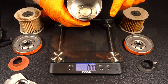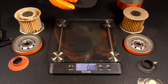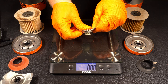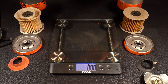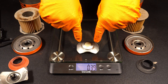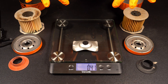Now this spring sits in here and kind of just flops around, whereas the new one doesn't have a whole lot of room to slop over into the wrong spot. The new one slides real nice, whereas the old one - could be an age thing - you can almost hear a crunch on some of these pushes. The metal on this old one comes up in a dome and then comes straight down, so there's material that this will rub up against. The new one has the dome and instead of coming straight down it goes inward just a little bit, so only the very edge is your friction point.